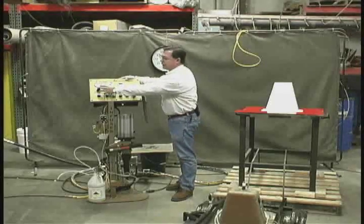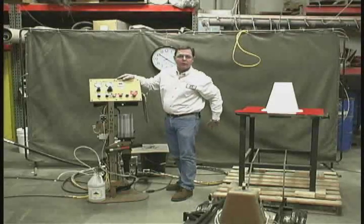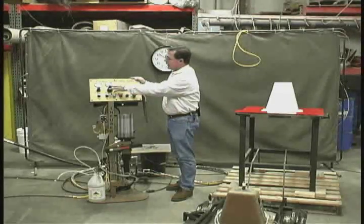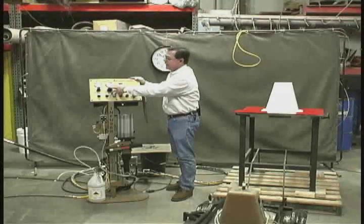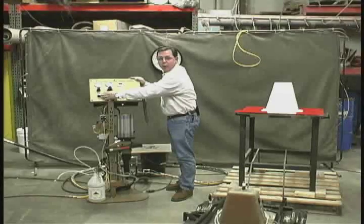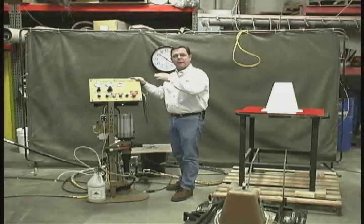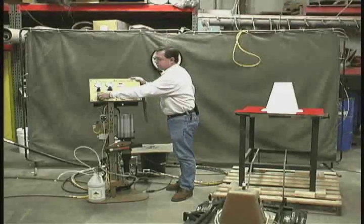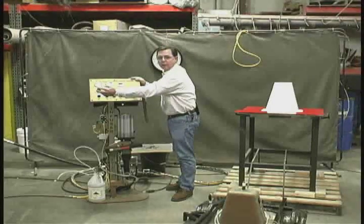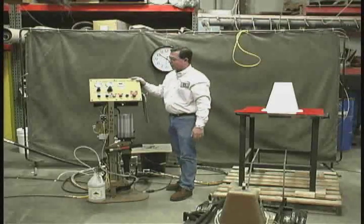We have here the ability to adjust the pressure — this is the injection pressure controlled at the mix head. Then we control the pump speed. The Aviator has the ability to recirculate or inject the resin. We can recirculate from the drum up to the mix head and back to the drum by simply switching from re-circ to inject. When it's in the inject position, the resin will go into the mold.